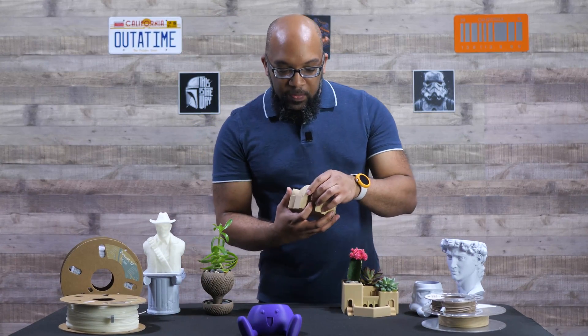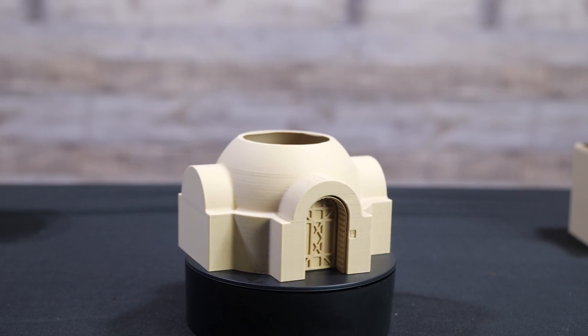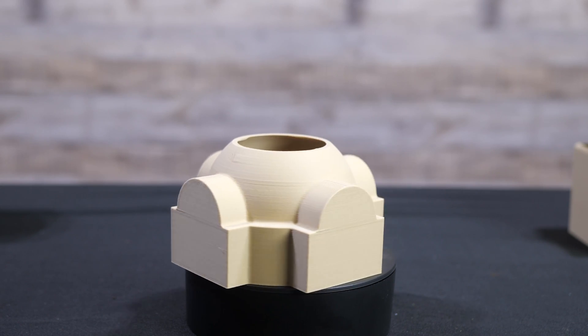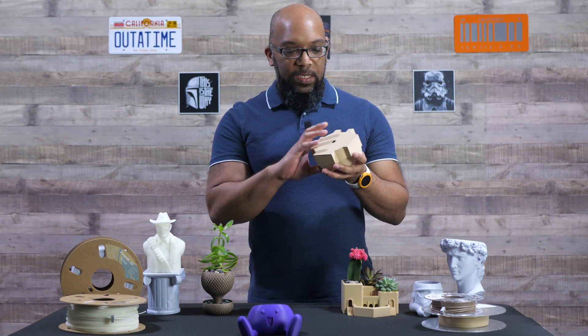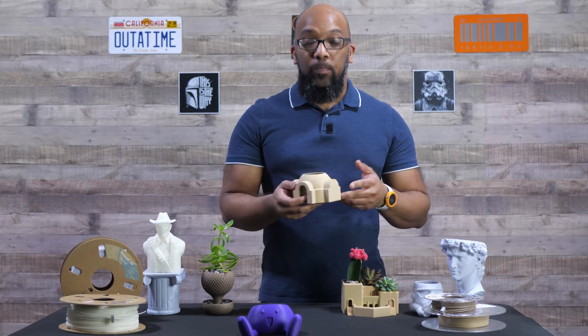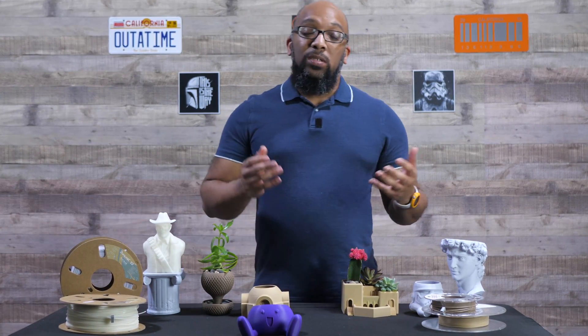The last thing I want to show is this planter of Luke Skywalker's house on Tatooine. It came with a little door you can slot right in — you can glue it or leave it optional. All the STL files shown here are free and linked in the description. It came out looking very nice with a smooth bottom and a clean drainage hole, printed with the 0.6 millimeter hardened steel nozzle on the FlashForge Adventure 5M using the regular high-speed PLA setting: 220 degrees Celsius for the nozzle and 60 degrees Celsius for the bed.